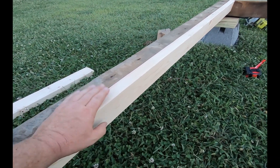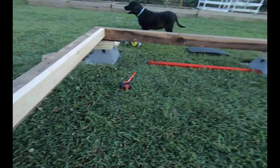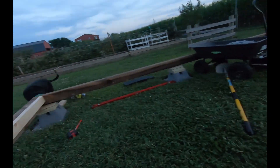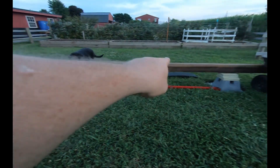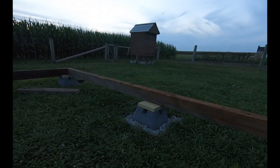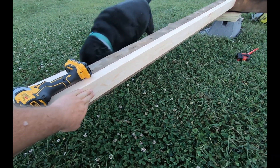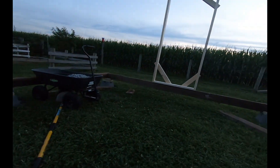This is going to be my stringer to attach my floorboards when I'm finished. This is going to have floor joists running this way — one big one will come right across the middle on the blocks, then I'll have some two-by-sixes flush with this on hangers along this side and on the other side. That's what that's for, and this will be attached with structural screws later.